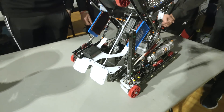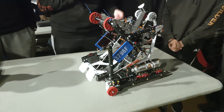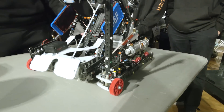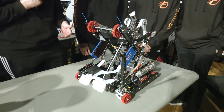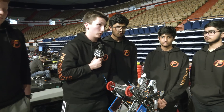Running a 600 RPM drive — did you have to give up anything to divert so much power to the drive? Yeah, absolutely. For the last two years we ran a consistent 450 RPM, 2.75-inch wheel drive base. We love that drive base — I drove it at Worlds and the beginning of this year. But we wanted more speed, especially for skills, where we felt we were lacking. We felt that with a little loss of power but more speed, we could make up for it.